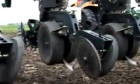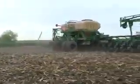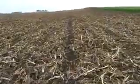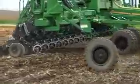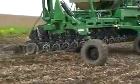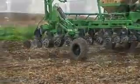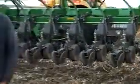When different people look at the planter, they think they're cast wheels at first, then I bring them back and show them the rubber — a few guys asked if we put them on our planters. The way the press wheels tuck the seed differently, break up a little bit of the compaction, and lift it back up around the seeds instead of just pressing it down firm. We were a little worried about sidewall compaction with the openers, but the press wheels kind of lifted that back through and broke it apart, so we've been pleased with the way they worked.